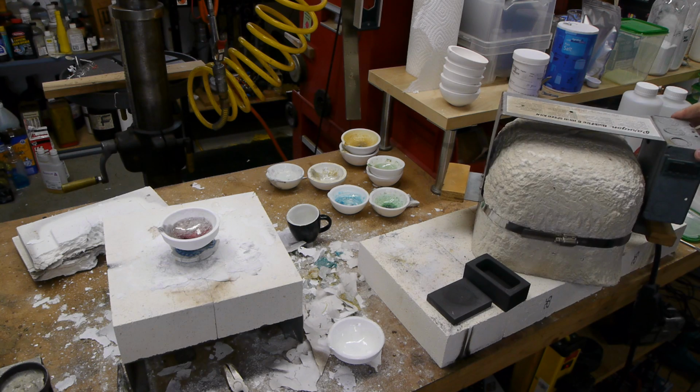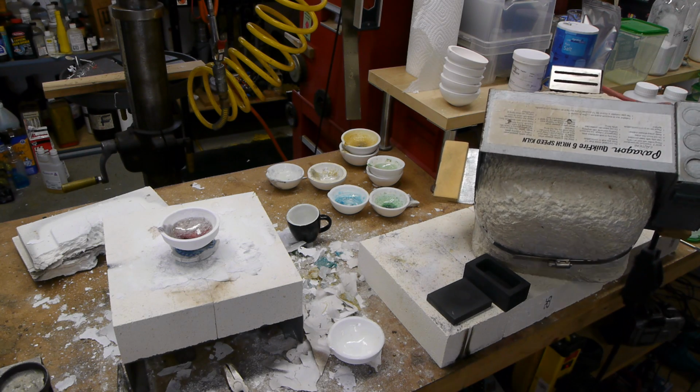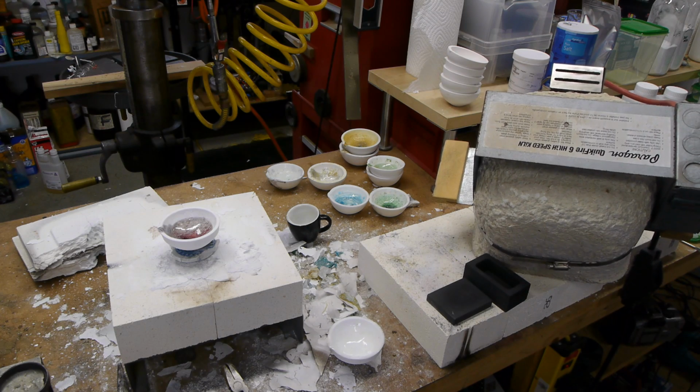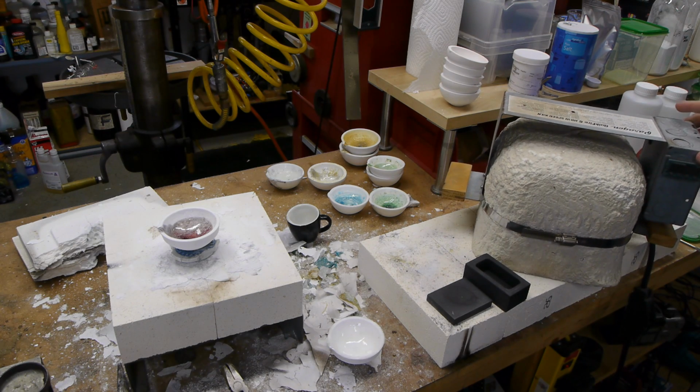This is the Paragon Quickfire. I bought this a long time ago. It's not sponsored, of course. This is about $300 new, I think, and it's actually a really good solution. The heating elements are rated to go up to about 1050 degrees C, but I've pushed it to 1150, no problem. One consideration is that it just comes with a switch.